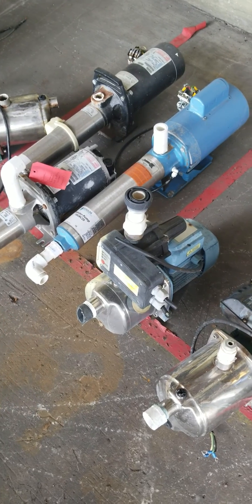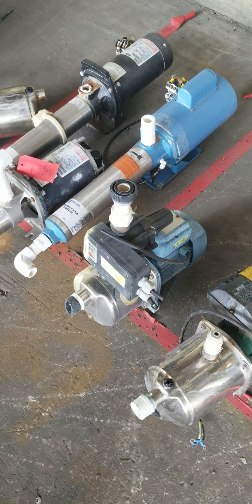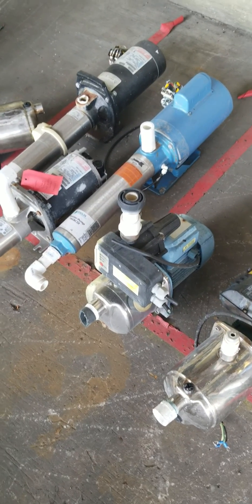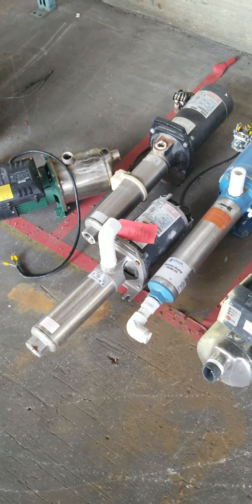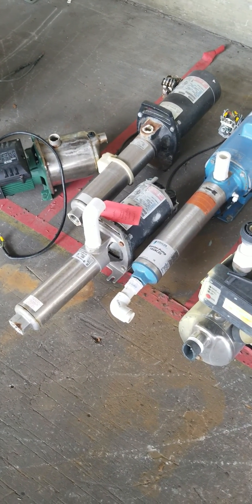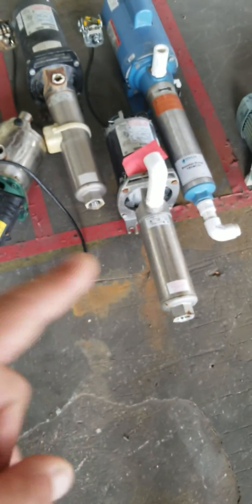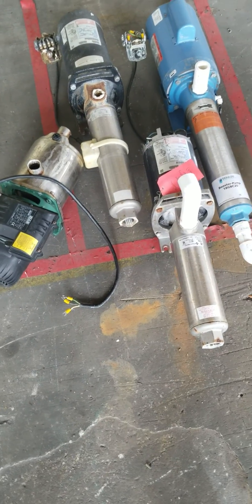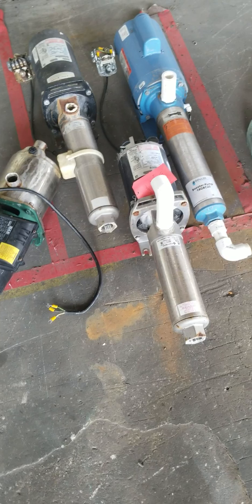This one's between four and four and a half gallons a minute, and again only 90 pounds of pressure. Our pumps run 150 to 200 psi, so you're going to get the best water quality possible. Our booster pump gives you about seven gallons a minute, and our systems make one gallon of good water and only waste two gallons of bad water.